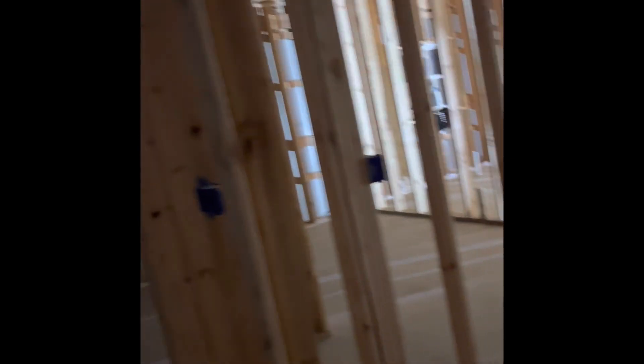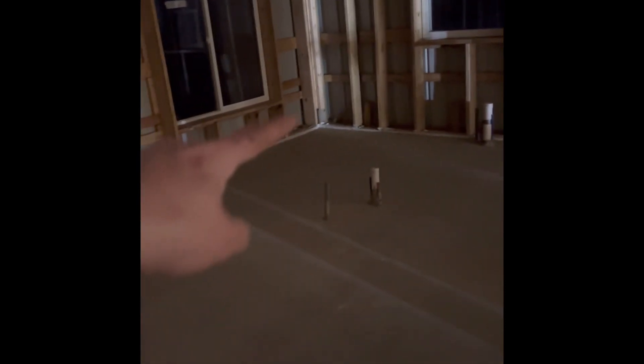For lighting I'll probably just do two, four, six, and then probably one or two up here so when you're getting into the deep freeze you can actually see. I'll try to get that done tomorrow along with the kitchen if I have time. I've got a groove figured out now — it's just been challenging figuring out where to drill and how to get around things. I'm going to run mostly 12-2 wiring, which is 20-amp breakers, except for lighting. All my outlets will be 20 amp, and I've got to run another one out here through that conduit into the large island.